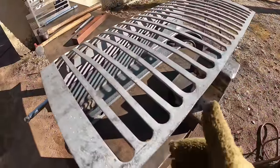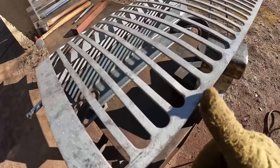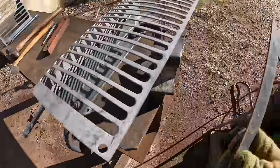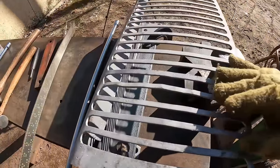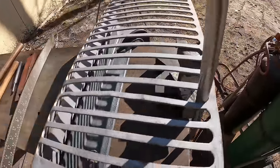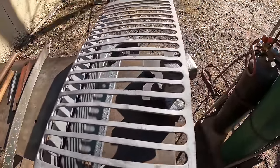I want to show you something right here off the end of my finger — we've actually buckled inward with this edge of the panel because this slat was bent so bad it really pulled on this edge, and this piece right here was the first to give. It actually scrunched in. We throw the straight edge up alongside it — see that gap right there? It's pulled in pretty far. So I'm going to try some strategic heating. We're fighting actual stretched metal at this point, where it's going to be really hard to get everything to lay back flat. First, to try to pull some distance back out of this really mangled slat, I'm going to throw this extension in here — pretty good match to that rounded edge. We can heat it in just the right spots and I've got a leveraging device to try to pull and hopefully straighten some of that back out.